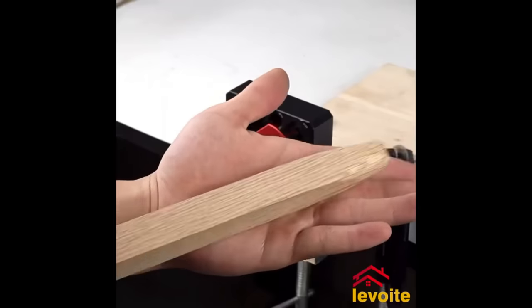The Wolfcraft Deckboard Drilling Guide offers a precision tool for drilling and driving screws into deck boards, ensuring perfect alignment and preventing crooked holes or stripped screw threads. Key features include a guide that snugly fits over boards, an integral screw starter, and a 4mm bushing tailored for 4mm screws. Its adjustability suits various deck board widths, and its robust construction ensures longevity. Simply set the guide's width, position it where you want the hole or screw, and then drill or drive the screw while using the guide for precision.